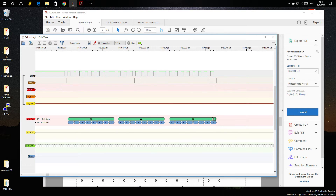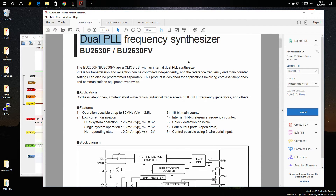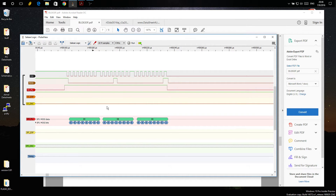Then we have the ID pins. ID0 is zero and ID1 is one when we're on TX. This radio has a dual PLL but only uses one side — the TX side. The RX pins are not connected. So when setting PLL options, you're only setting the TX PLL. If we were using both, we'd see four packets since we'd have to set four registers. Right now we're just setting the TX registers. Since this is the reference packet, it should be virtually the same every channel change.